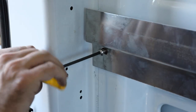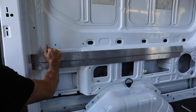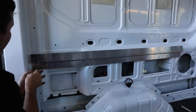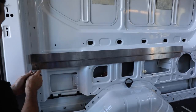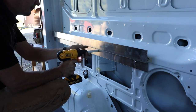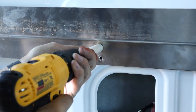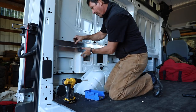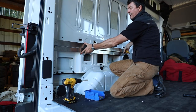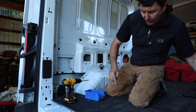I enlarged that hole just a little bit to oval it out and it should fit in. Now the rail is secured with the button heads and won't move, so we can do all our pilot holes for the rest of them. I've got my layout done and we'll just go along and center punch all our contact points. Got the holes all drilled - now we can take this out and drill the body side the next size bigger.